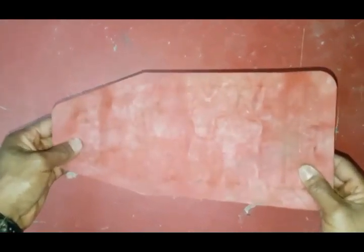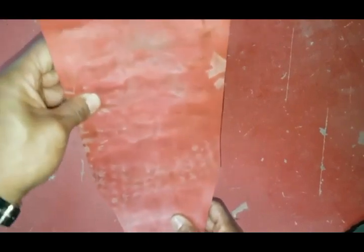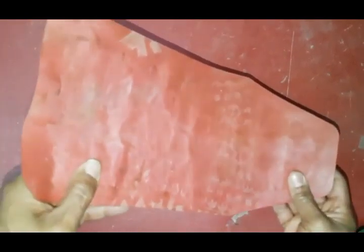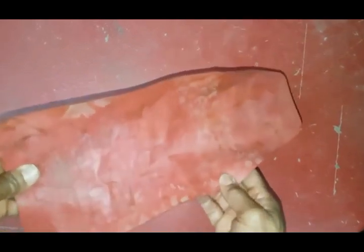This flat device is handy for when you're taking out pumps, say in a combi boiler. You can place it at an angle so that water is deflected away from an electrical component like the PCB and then goes into a bucket. It's quite stiff so you can bend it into different shapes — like making it into a funnel shape — to deflect the water away from any electrical components and protect them. A quite handy tool to have.